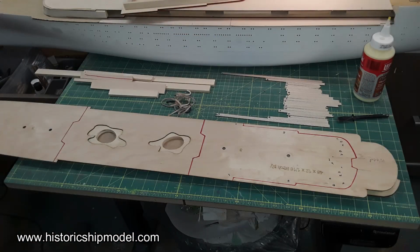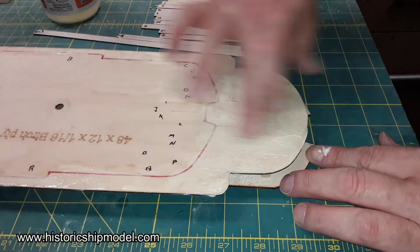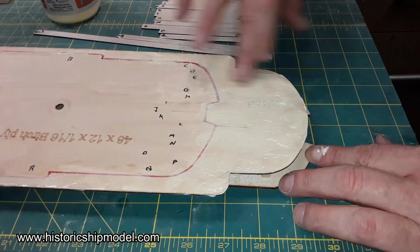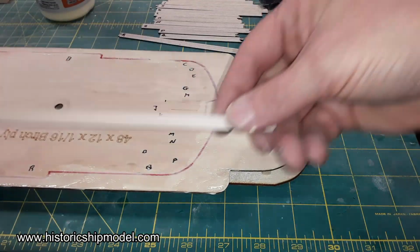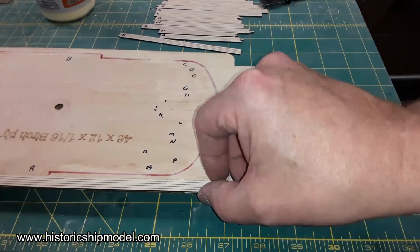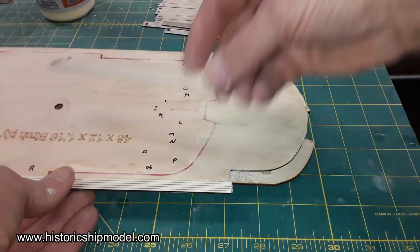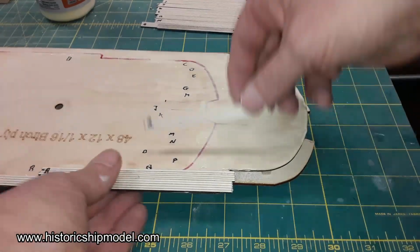Start by laying out the subdeck and any clamps or glue you're going to need, and then lay out the planks in the correct order. Spread some glue on the subdeck, and then apply the planking sections one at a time. Press the plank sections firmly into the glue and tightly towards one another.